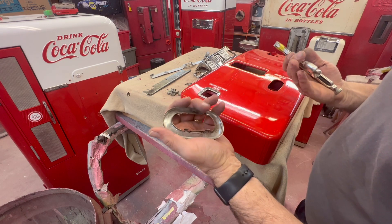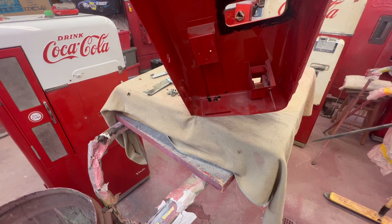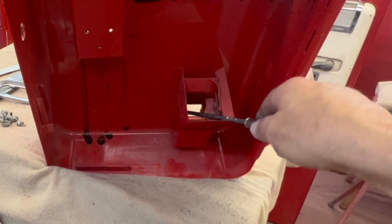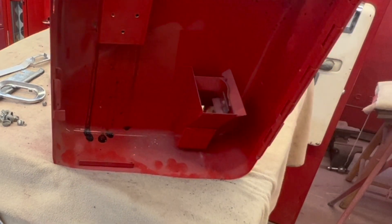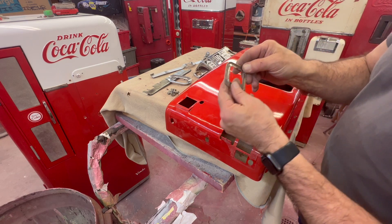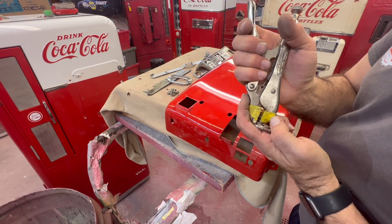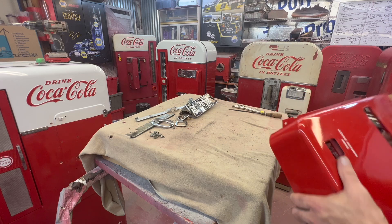The smaller one is a little bit tougher - same scenario but a little tough to see on video. Get that one started and once you get underneath it, that one's off, and it looks like the other one's just about off already. Be careful when you're pulling up so you don't bend these. The side ones are very very small - thank goodness, because they would be really a pain if they were long. Try to straighten those up too. This one goes to the chrome shop as well. So the coin door is done - it is ready to go to the bead blaster and get stripped totally back down to bare steel.